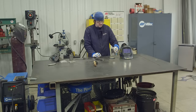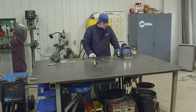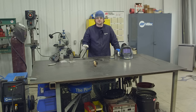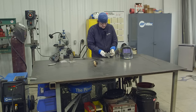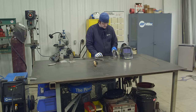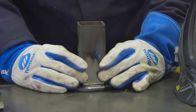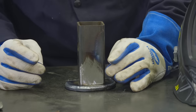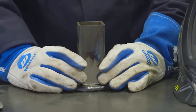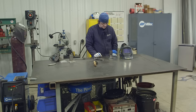I have the backing part of the skull done — I just welded all the way around it real quick. On the other pieces I'm going to measure out and center the tubing, but on this one, because the skull itself is kind of an odd shape, I'm just going to eyeball how I want this to go. You can also tack it in place, take it out to your truck, set it up, see how it looks, and adjust as necessary. I think this is going to be pretty close, so I'm going to tack it and then weld it up.